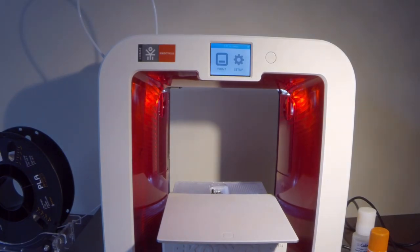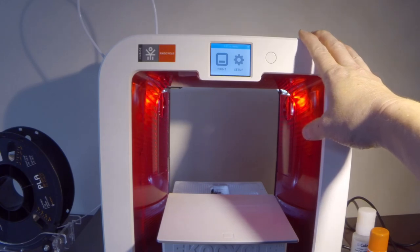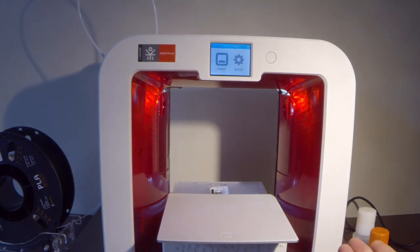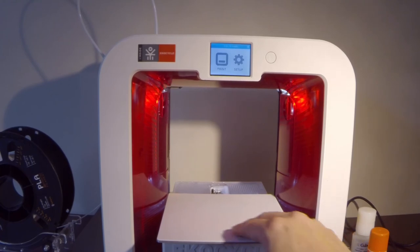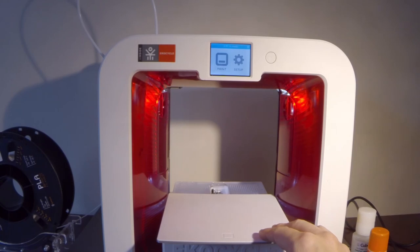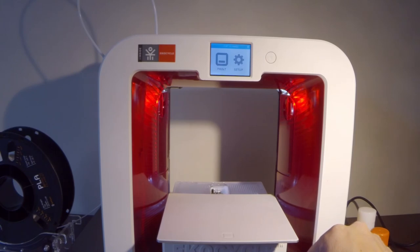I've got a buddy who's had one of these for years, and I hooked him up with an open source cartridge. I didn't realize he just lived off auto Z-gap. And I said, hey, make sure you Z-gap it properly after you get this. My tips are a little longer. He ran auto Z-gap, went to print, sent me a picture of his print bed. And he said, hey, what the hell? I've got these huge scratches on my print plate and my tip is clogged now. And I fixed it for him. I said, yeah, never, never, ever trust auto Z-gap.